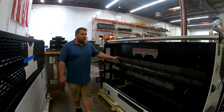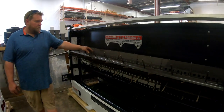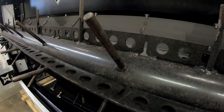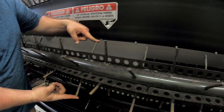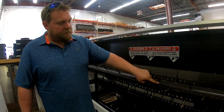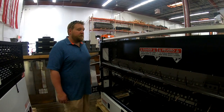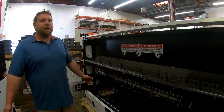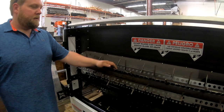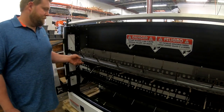Here we are at the backside business end of a machine that has augers in it. This is an all-steel-constructed auger. These tines are not welded to the surface of the metal — this shaft is actually one big piece. That's an 11.5-inch piece of cold-rolled 3.125-inch steel. When this gets pressure put on it, it transfers the pressure through the tube into these paddles, acting as an exoskeleton design. So you can make this very light and very strong — it'll last a very long time. If this is welded to the surface, they'd more than likely just snap off in one year. The paddles actually allow the mulch to flip over and also help inject air into the mulch, getting you that higher yield — every 10 yards, the paddles spin and fluff the mulch for more yield.